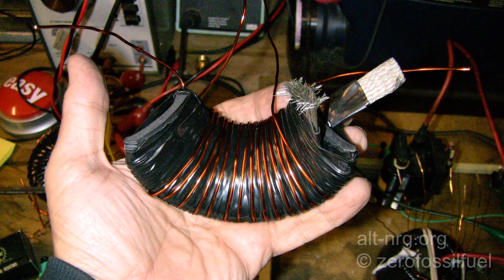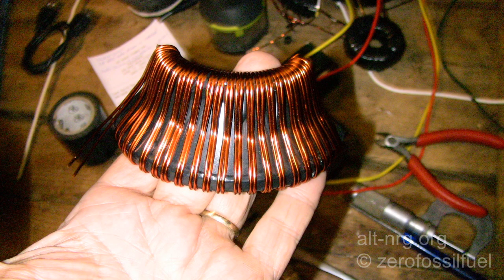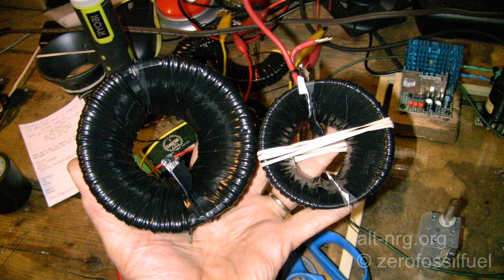Here is the 50-turn coil now covered with electrical tape and the 15-turn primary on top — I think I only ended up using 14 turns on this particular primary. Here is the primary side fully taped and insulated, and here is the secondary side with the 22-turn bifilar coil wound on it. You can see the bifilar windings are parallel all the way around the core, even on the inside. I'm now holding the fully assembled larger ferrite bell-shaped core next to the smaller ferrite core I was originally testing with, to show the difference in size.